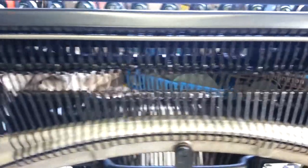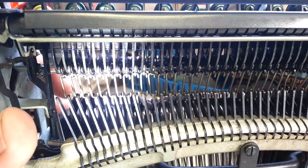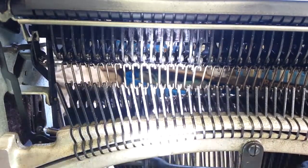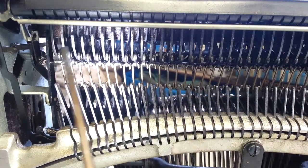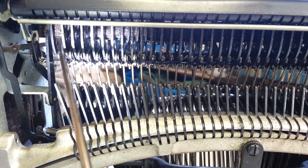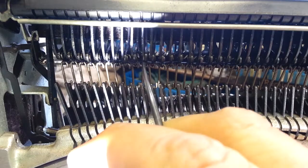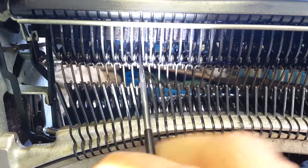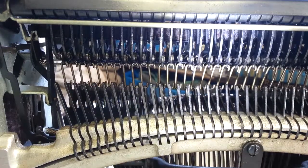Same as on the modern Classic 12s, there's a typewriter rest pad up in there, and this one is made out of felt — a cork-looking material right up there, but it's not cork. It's felt on this one, and it's compressed a little bit. What it causes is these keys should be sitting down a little bit, right there. I'm thinking that felt has got to be replaced, or something has got to be put in there to make a difference in the gap.